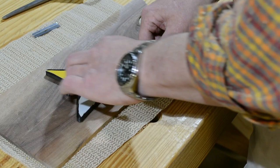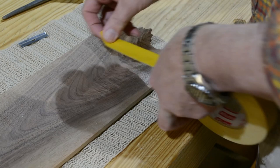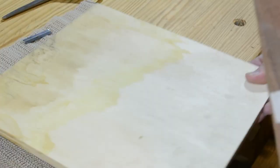This is a really bad scrap of walnut that's not even the same thickness, so I'm trying to figure out where I need to put it. There's a nice spot of burl or crotch grain right there in the cutoff, so I'll take that piece. One important thing: if you're cutting thinner pieces and may cut through entirely, tape the back as well and apply it to a backer board, so that in the event you cut through by mistake, it won't move around.